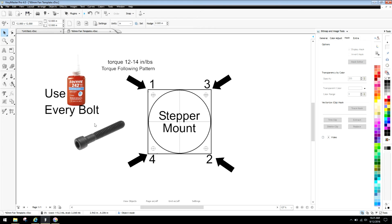What it basically does is it fills the screw with a nylon-based additive that, once installed in the thread pattern of the hole, dries into it and creates more resistance so the bolts don't vibrate loose, which we all know vibration is a culprit on anything you're building that's precision, where most guys are using large spindles, some of them in excess of 3 horsepower. There will be vibration. So again, this should be used on every bolt. It should be used the same process on every part of your CNC. You can use this torque rating virtually on all parts of your CNC.